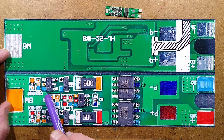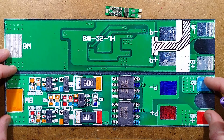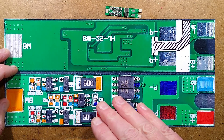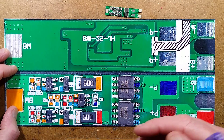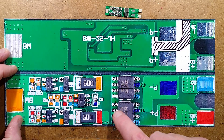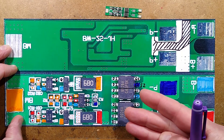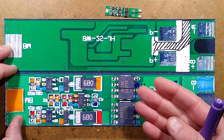We've got the control section which monitors the voltage across two cells. The cells are connected with the extreme negative end to one pad, the extreme positive end to another pad, and the center connection to a third pad. As soon as one of those voltages exceeds 4.2 volts or drops below the safe cutoff voltage, it will turn the output on these pads on or off via these MOSFETs. These are dual MOSFETs - you could remove one and it would just trip at lower current. The reason they've used two is for greater current handling capability.